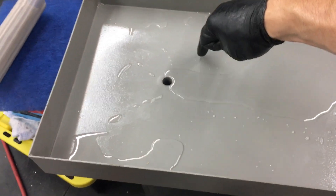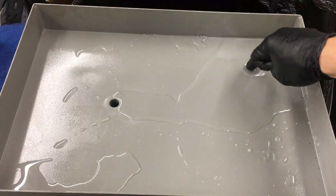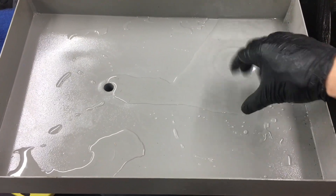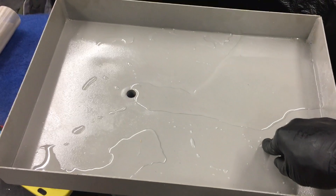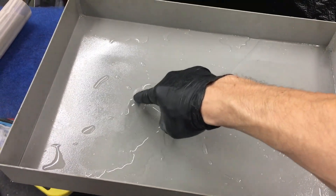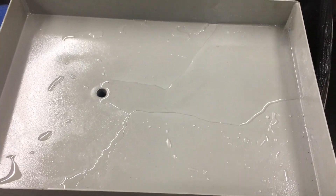What I'll do is go back and in this area right here — especially in here and in here — take the press and press this down just a little bit to deform the metal. Don't go too aggressive, because you can pop your welds around the perimeter. So just an FYI, hope that helps. Any questions, comment below.